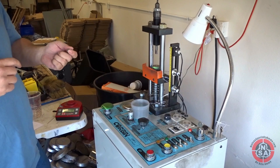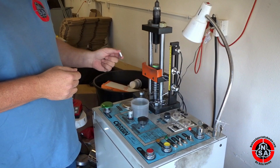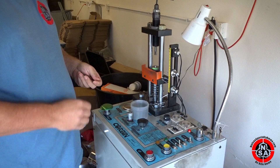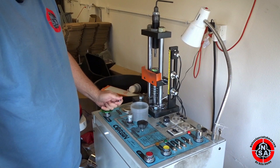This is our Corbin swage machine — we actually have three of these. We're going to take this blank that came out of our cast machine and put it into the die. This is a .45 caliber die and we're going to make a 240 grain bullet — anybody that shoots our 240 grain .457, probably out of a Texan SS, this is the bullet we're making. That blank went into the die, gets pressed in, and you see excess lead coming out. It's got the hollow point and a dish base on the back.